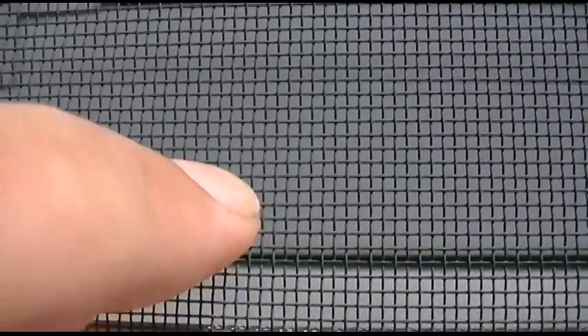Now the filter has water going through it. But being a diatomaceous earth filter, let me explain what it is. Inside of that are a series of grids — not unlike a window screen. It would obviously look like this. The DE, which I'll show you in just a moment, is a very fine powder that goes in here and almost clogs up all these little squares. And that allows for very small particulate matter to be filtered. You can see that these squares, while not very large, can allow some pretty sizable chunks to go through. The DE coats these filters and helps filter everything out.